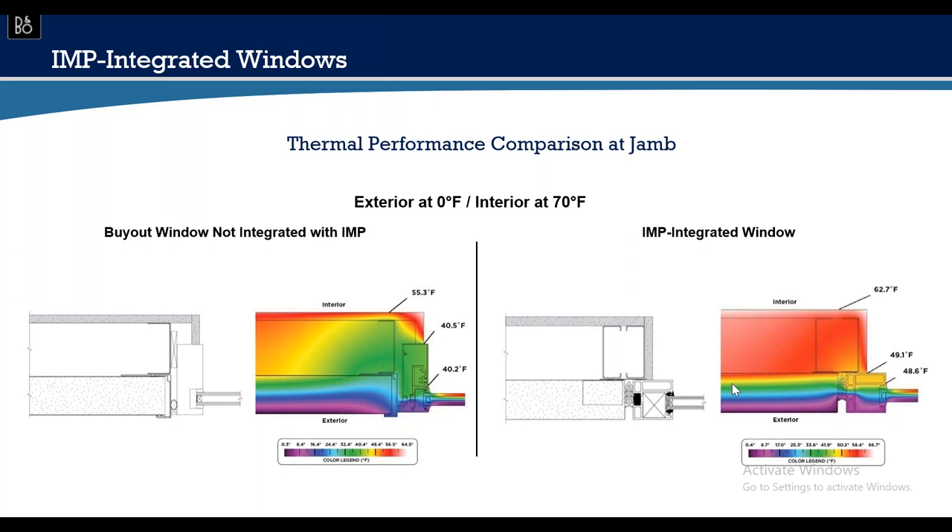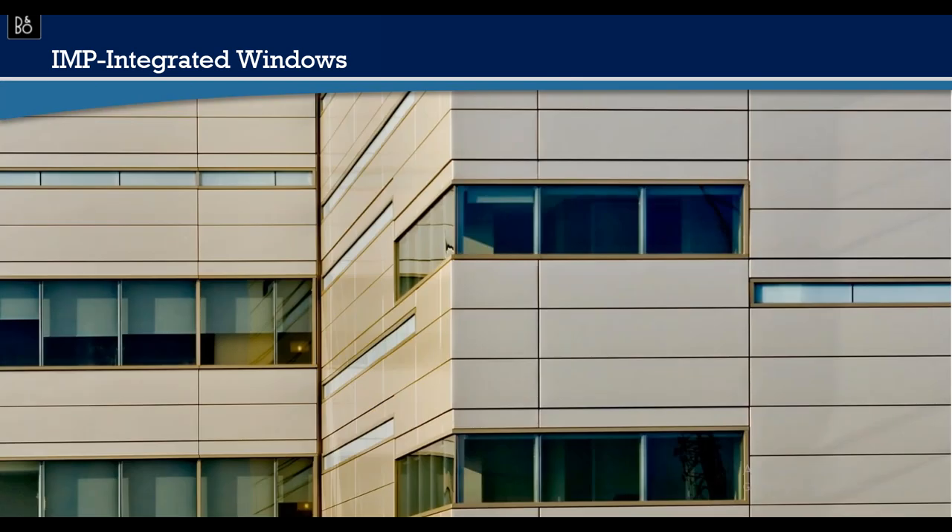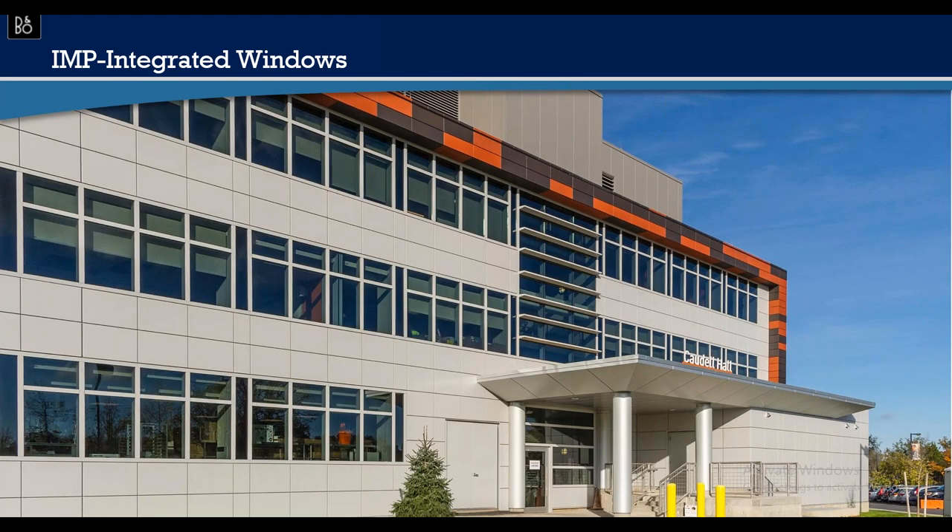What you see in this photo is a very clean facade with no streaking — the sight lines are exactly what the architect intended because the windows are truly integrated, with no extra flashing. An integrated window system doesn't limit design. You can have a full butt-glaze system with larger or smaller windows, more complex designs with full mullions, or a stacked glass design — all within the repertoire of an integrated window system.